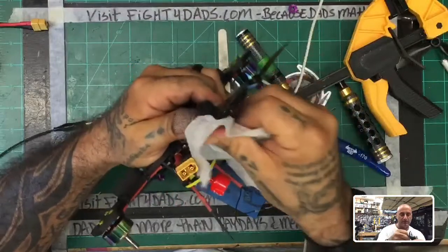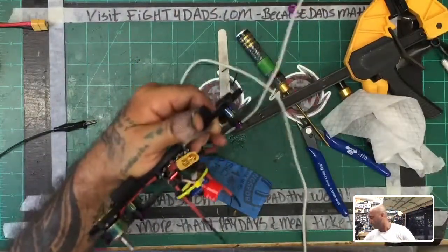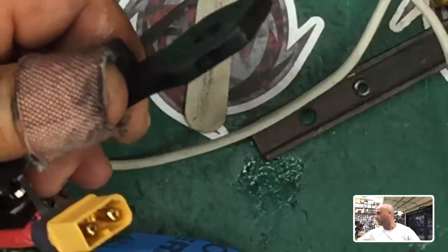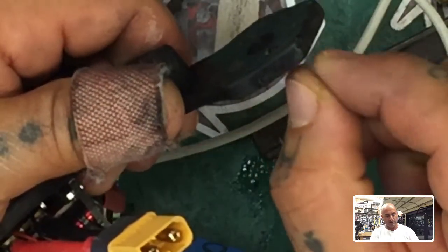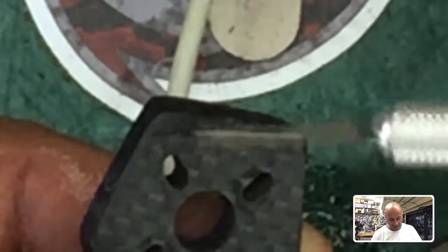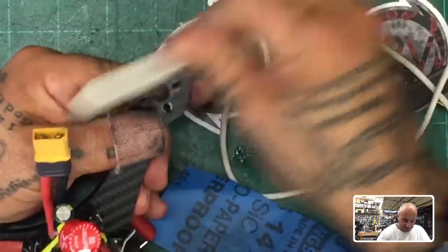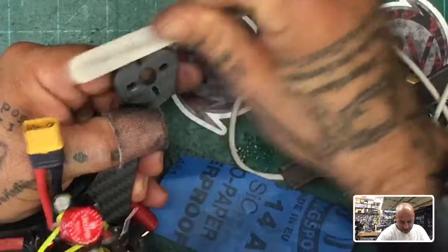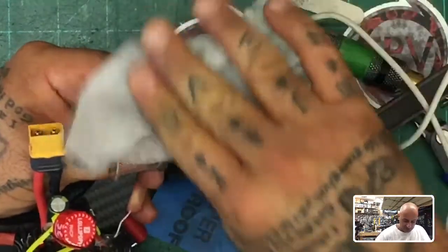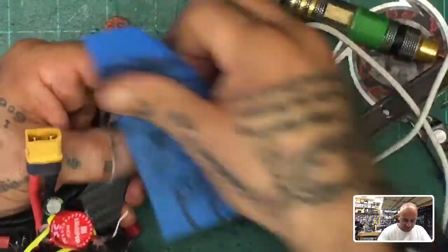They will leave some fiber behind, so you'll be able to feel it. Right here I can feel — and I don't know if you can see it — there's a little bit of fiber right there. That tells me right here there's still a snag point. And you can take a razor blade and feel it hit right there. So we have some more sanding to do right there. That's why I use these cloths — I like the way they give these tells away. So I'm going to go ahead and quickly sand and try to blend that in, then use the 2000 grit to finish it off.